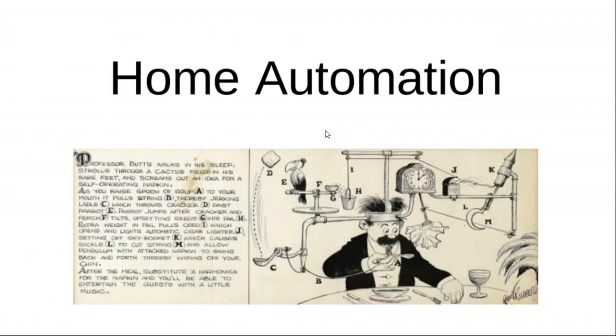Just as an example, I did a limited budget off-grid home. They didn't have the $100,000 it would need to do a high-end off-grid system for a 5,000 square foot home. They only had 65,000, but they wanted that whole house power. So we found a 12 kilowatt cheap all-in-one inverter that could be connected to the battery bank and run the house off-grid. The problem is, if the house goes over 12 kilowatts in power, yes, these inverters have burst capacity to ramp up for short-term loads, but by short-term loads, we're talking about 1 minute loads or less. Not an air conditioning system that's going to run for 15 minutes straight.